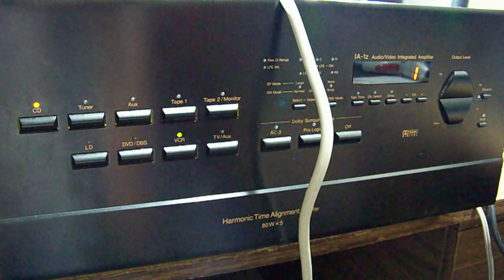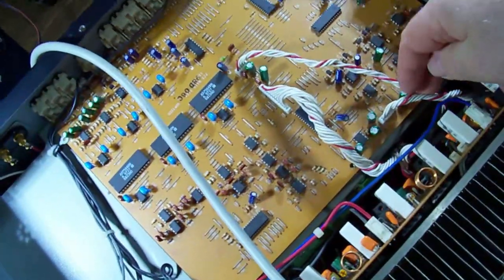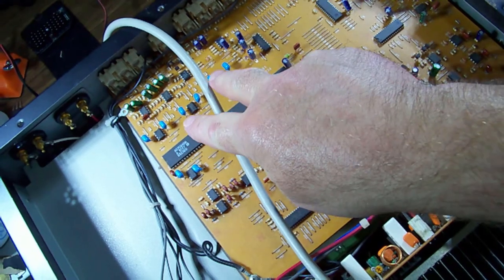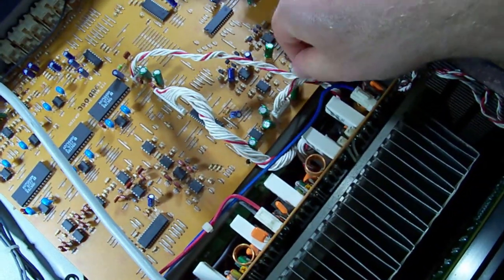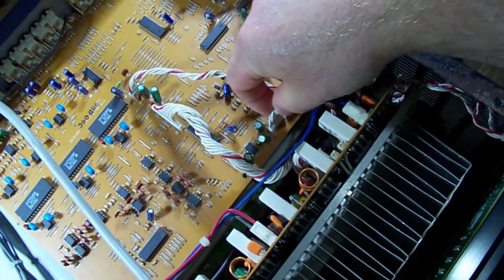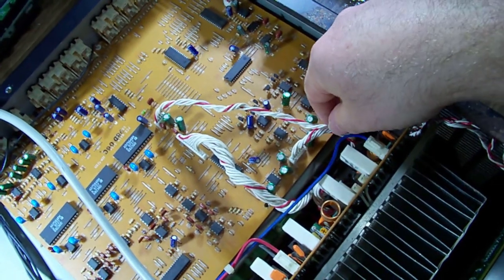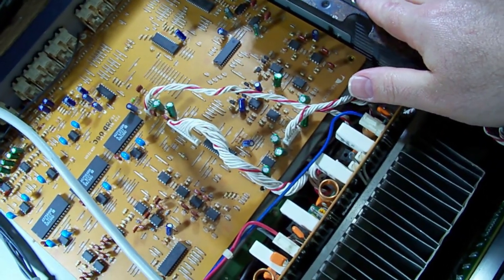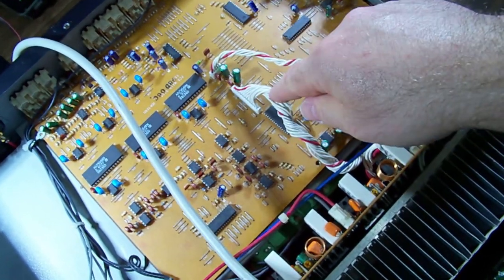Something just gave up in a rather nasty way. I'm still thinking it's on the digital board on the bottom. What I think happens is this line from the digital board feeds the digital to analog converters which then feed the output to the amp. There's a selection of op amps here - these chips select the source and it comes through the op amps. There's no activity - no clock or data activity on these ICs - which is not a good sign.